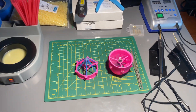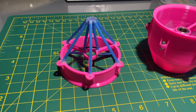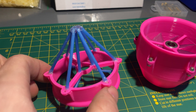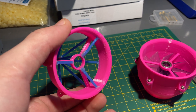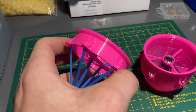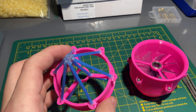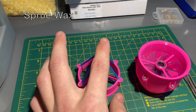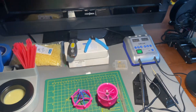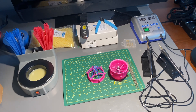This was my first attempt ever at forming any kind of sprue structure, gates, or anything, and I'm really happy with how it turned out. I used a little bit of red wax at the top but it's mostly blue wax. Using the pen, the sticky wax, and the dobbing station it worked very well. I don't know if I'll end up making this part — it's a prototype for an electric ducted fan I'm working on — but it looks really great. I'm still waiting for the large sprue base that would connect to it, but this is my wax working station and I'm happy with it.